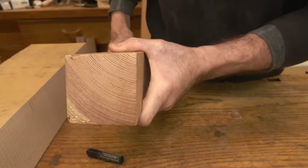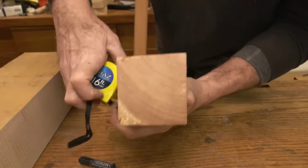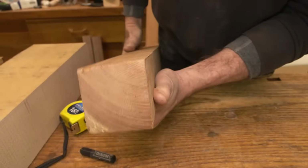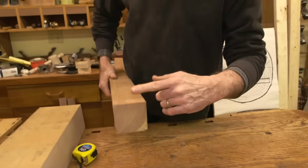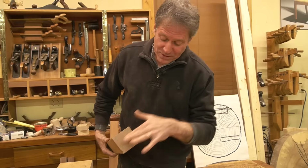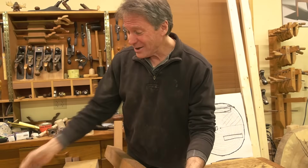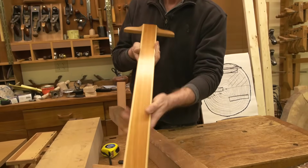Wouldn't you be? What is this? This is not even 3 inches. Oh yeah, 3 inches. Do you know that this piece is 103 years old? Across 3 inches of thickness. Crazy. Isn't that beautiful? And we actually used some of this stock, if you recall. We quarter sawed it. I could rip this board this way, so I end up with the grain perpendicular, which creates this beautiful, stable material and also a very attractive linear look. And that's what we made this drafting board.